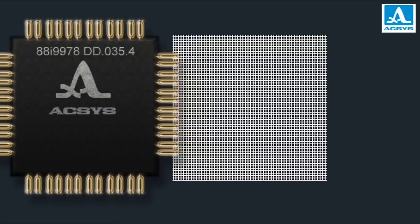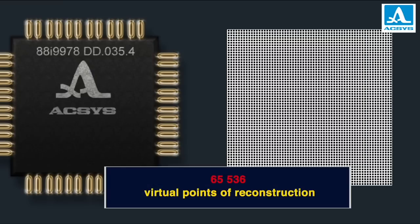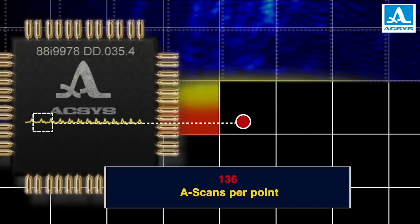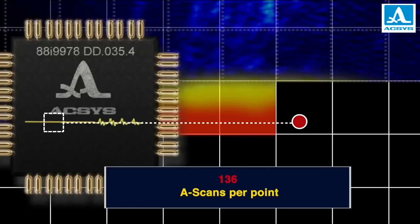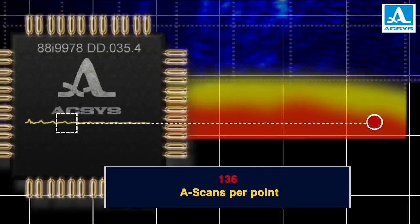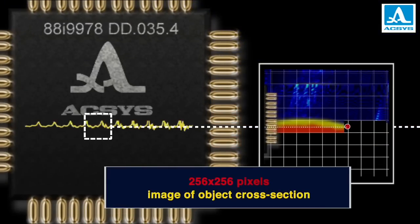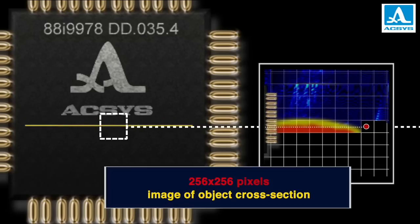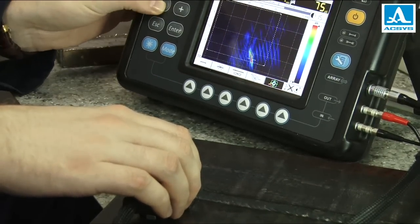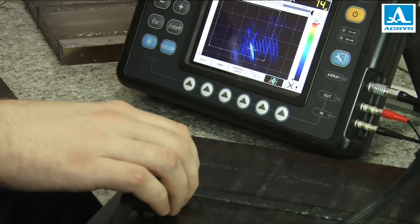The processor of the Introvisor operates a matrix which mathematically describes the cross-sectional area. It consists of 65,536 virtual points. For each point, the embedded computer goes over all 136 echograms received during pulsing. Areas corresponding to the coordinates of a point are analyzed. The cumulative value is saved to a memory location fixed to the point following the rule of superposition. The procedure is repeated for each point of the cross-section. Finally, a high-resolution image of 256 by 256 pixels is obtained.